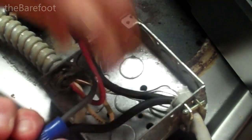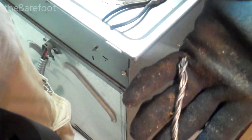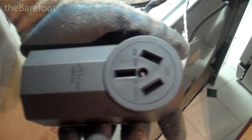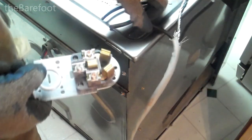Should be, but — the best laid plans of mice and men. You're probably about to see an edit in the film. I haven't yet prepped all the wires. I did kind of clean up the aluminum here, cut off the ends, and re-twisted that nice and neat. I still have to strip down the hot wires, but I wanted to go ahead and open up this receptacle. You do that by loosening a screw right here in the middle, and then the back slides off. I wanted to get that opened up so I knew how long these wires need to be to make good contact and fit all nice and neat.